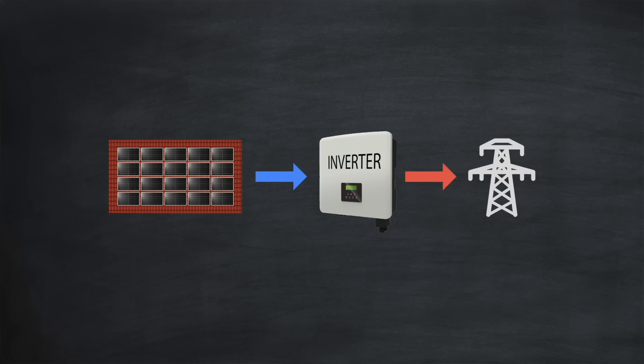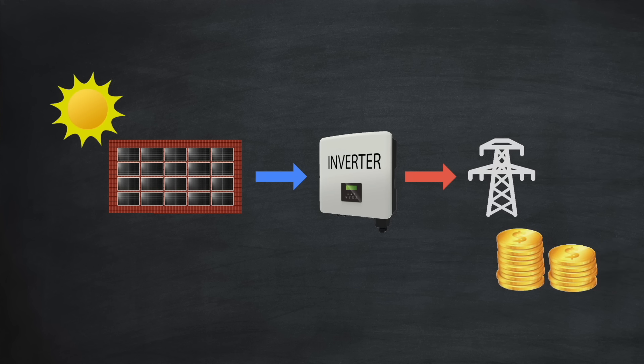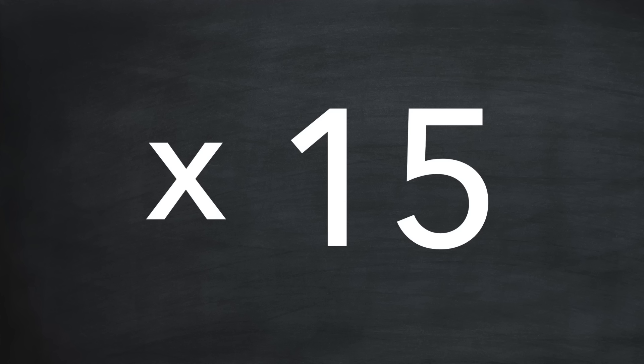We've talked about reasons why oversizing your array is a good idea, but there are a couple of very important factors to consider depending on your inverter size. The first is to do with export, where you can get paid for any excess solar generation you send back to the grid. A smaller inverter means you're more limited on the power you can export, and on a sunny summer's day you might welcome a larger inverter if you're on an energy tariff that pays handsomely for every kilowatt hour you can export. And if you have a DC coupled battery, a larger inverter can come in really handy if your country operates demand flexibility schemes, because in those you can get paid up to 15 times what you normally pay for that energy.